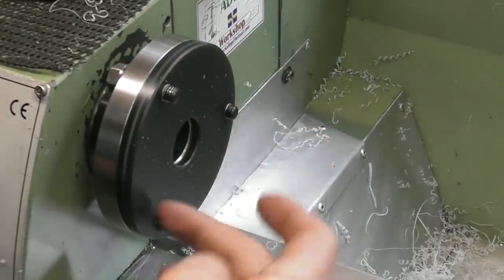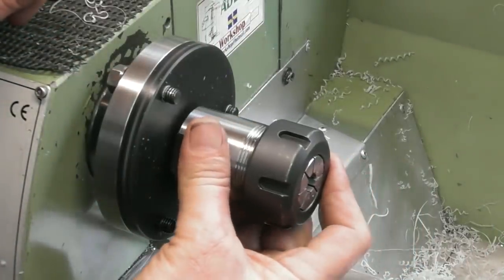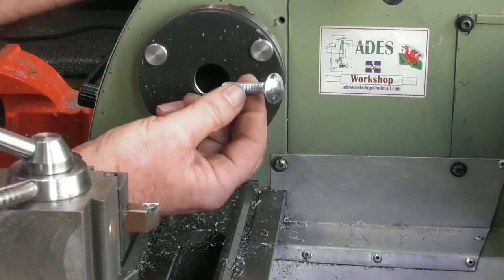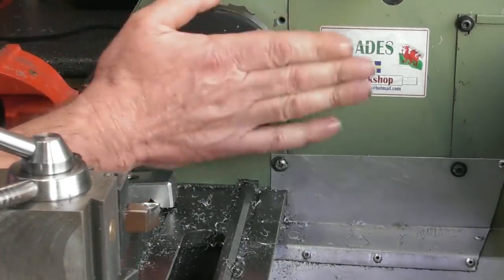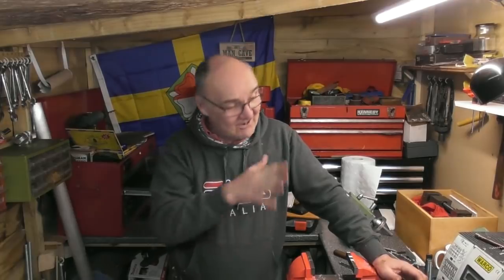Well, there we are. Other than replacing these temporary studs with those coach bolts as I said earlier, we now have a protector for the register and face — and it sits in there beautifully. I managed to get to the shop, got a packet of coach bolts, skimmed down the square head, ran a thread up them, reduced the head size, thinned them down, and put a radius on them — job finished. Simple and cheap, out of a bit of chopping board. I can rest assured I'm not going to damage the register and headstock when I'm using stuff in the Morse taper. Happy days — thanks for subscribing and watching, we'll see you all soon.